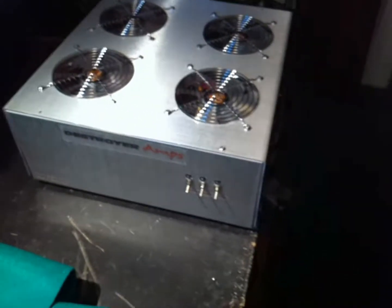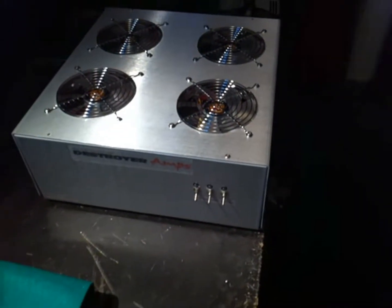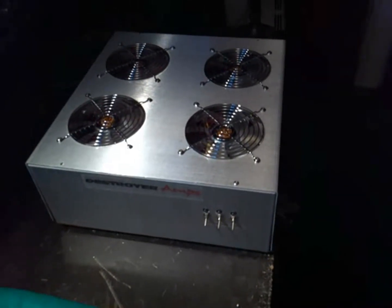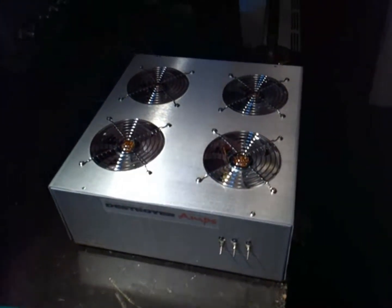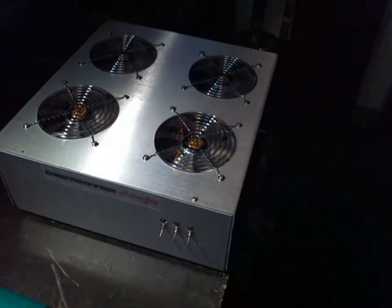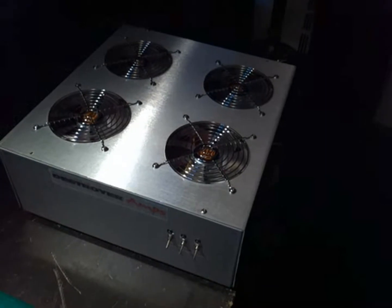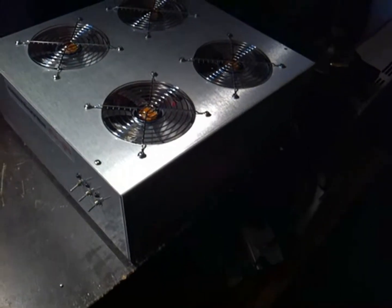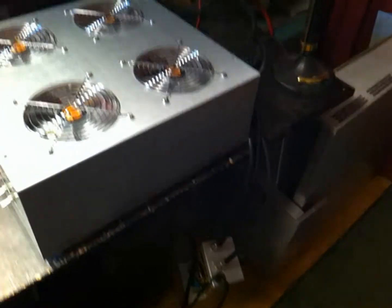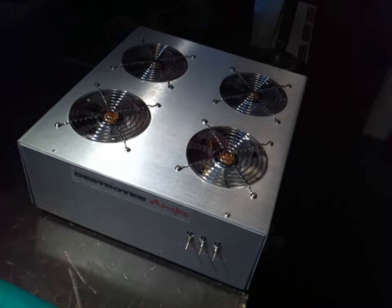One thing about these bias amps — they don't require much drive, so you are not going to see as many watts as you would on a class C amplifier. We are driving this thing with a 114-46, so we will probably get anywhere between 85 to 90 some watts drive input. We're going to hit it with a mild one-pill and she should net anywhere between 950 to maybe a little over a kilowatt. You can drive it with about 150 watts and probably see about 1150 out of it max. A class C amp would definitely see more — ballpark between 1400 and 1500 watts, no problem.